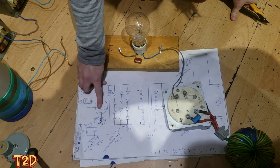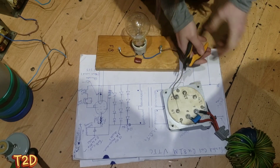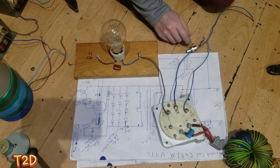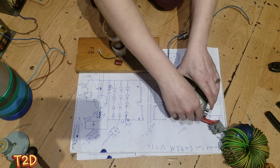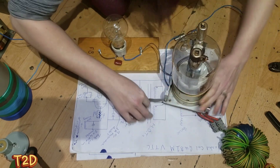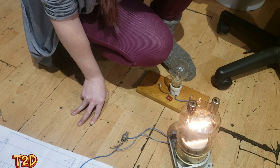I've made a mistake - as you can see on the schematic, grid 3 is connected directly to our neutral connection. The CT actually goes through the SCR, so we can't connect those together. We've sorted that out and it is now exactly as shown in the schematic: G3 is tied directly to neutral and the CT is connected to one side of the SCR. Now we can insert the tube into the socket. We've plugged this in for a final test of the filament transformer and we've got 12.7 volts, which is perfect.